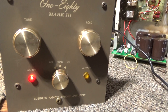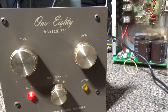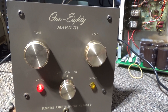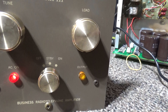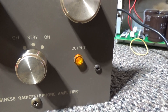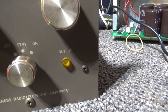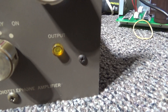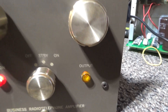We're going to put it on the 200-watt scale. We already did one recently on this amp, but we finally got in a lower voltage zener, so we put that in and we're going to fire it up with the low voltage zener on this last Browning 180 amp I've got. Switch it from standby to operate — helps if you turn it to operate if you want it to operate. It's not quite as bright as the higher voltage zener, so you lose just like everything — it's not a zero-sum game. It runs on lower voltage and lights up the way it's supposed to, but it's not quite as bright.